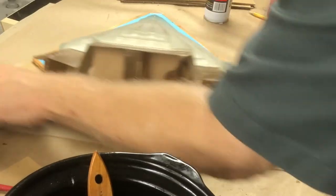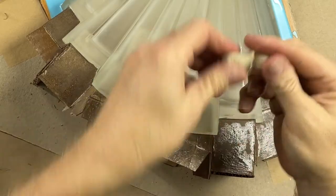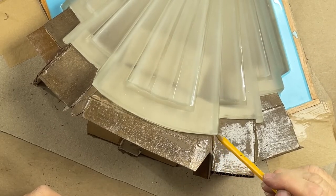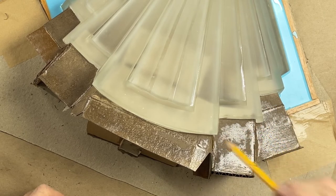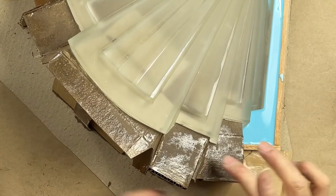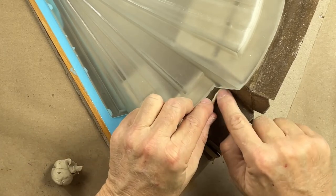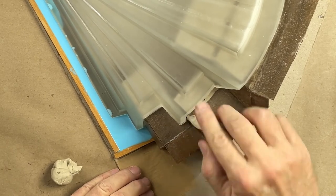Now we break out the wonderful, magnificent, and happy oil clay lumps. We have to go around all along the edge, all the way around, and very carefully build a nice clean oil clay ridge. I'll be rolling out little worms, pushing the oil clay up underneath the form and underneath the glass, making a nice tight seal and a smooth, clean parting line.